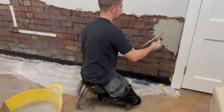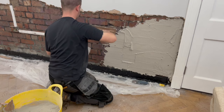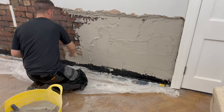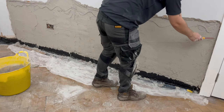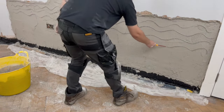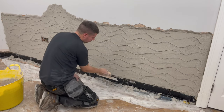As you can see, for an undercoat plaster this first batch was a bit too thin and watery, but it's on the job and it's stuck to the wall — and this is only the first coat. For the first coat they recommend between 5 to 10 millimeters thick. It's a scratch coat so it needs scoring up — I didn't have a scratching tool so I just used a small screwdriver and made wavy lines. I also neatened up the bottom edge to make it easier when fitting skirting boards.